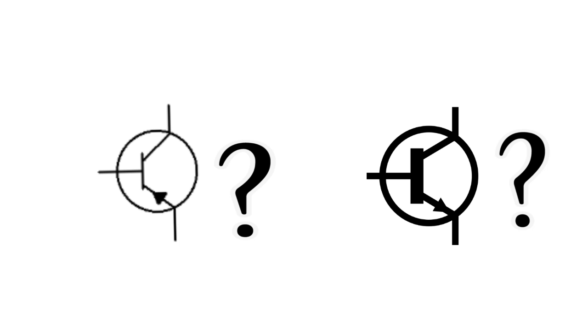I know this is an NPN transistor — it's actually a 2N3904, it's very common. Now if you don't know what type of transistor you have, if it's just some mystery transistor, this method will most likely tell you if it's good, bad, NPN, or PNP.